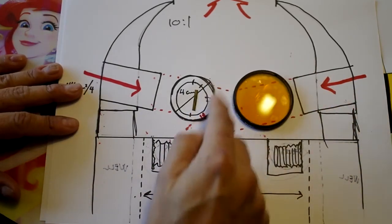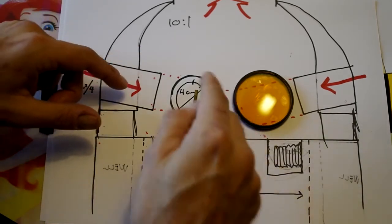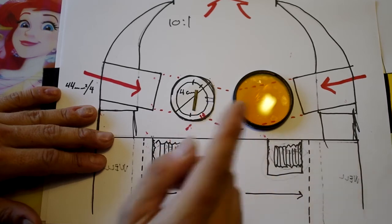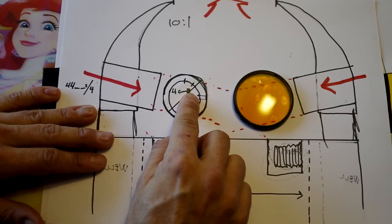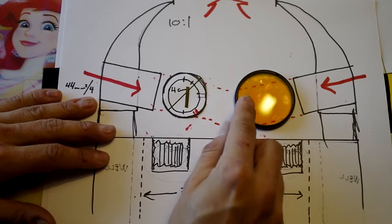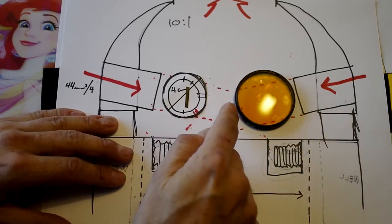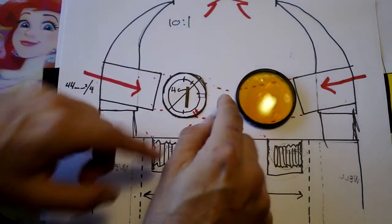So when the collision happens here, as you saw in the video, you saw flicks of vapor struggling for power in this center. That's not good. So you need to resolve this. I propose to move your coil as close to the tube as you possibly can. Give as much space as you can for the collision of the flows, so you get the separation points as close together as possible.